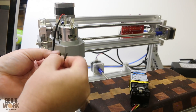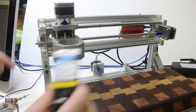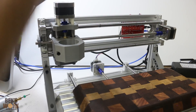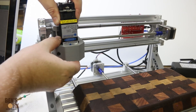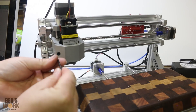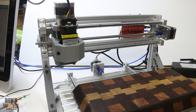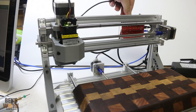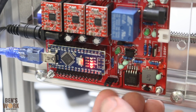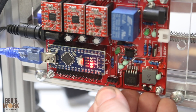Undo this allen key on the side here and pop your motor out. Now there's four little notches in the plastic housing here — just make sure you line that up. Push it all the way down and tighten up the allen key. Plug the power in. Now there's one more important step when swapping from the router to the laser engraver — this jumper pin on the back here. You need to pull the jumper from the left and put it to the right.